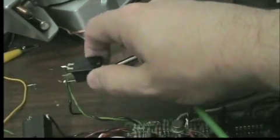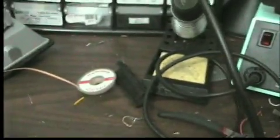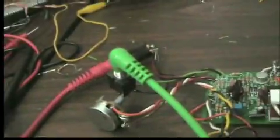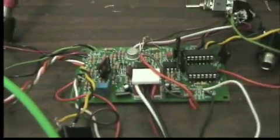You don't have to use the inverter with the pulser — the inverter just happens to be on the same board, but it's a standalone circuit. So let's plug that into the output and take another patch cord. Here we've got another patch cord — let's plug the input of the inverter into the output of the pulser itself. So the output of the pulser is up here. Now we have a nice upward going sawtooth wave.